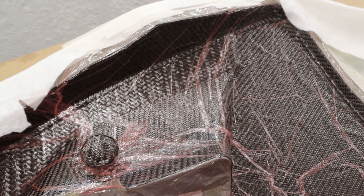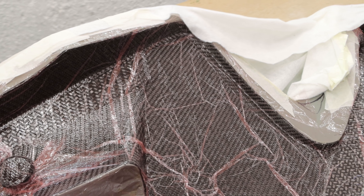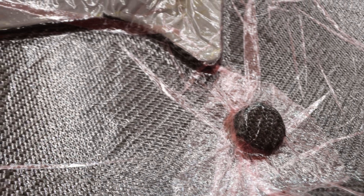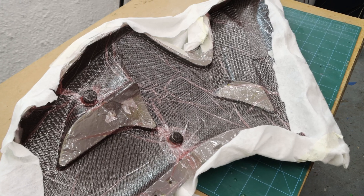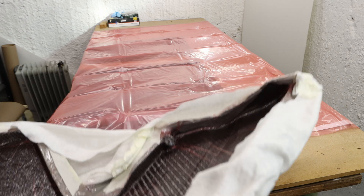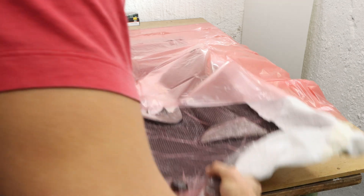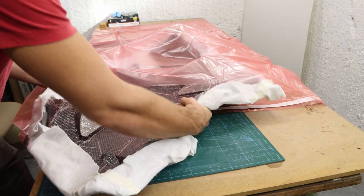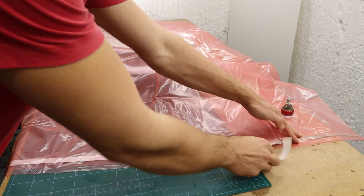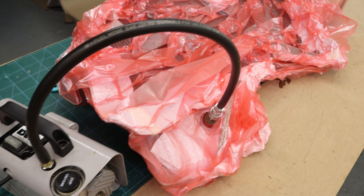I used the unperforated release film before curing. The release film keeps the resin where it's needed, ensuring the surface of the prepreg isn't marred or sticking to anything else when it comes out of the mold. Unlike perforated films which allow excess resin to bleed through, unperforated films keep it contained. The mold is then covered with breather cloth. When pulling a vacuum to cure the prepreg, air needs a way to escape, and the breather cloth provides that pathway — it absorbs excess resin and lets air move, ensuring a snug fit around the mold.